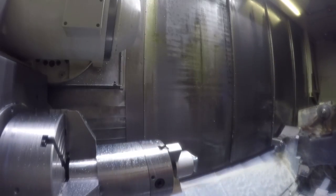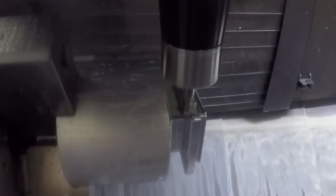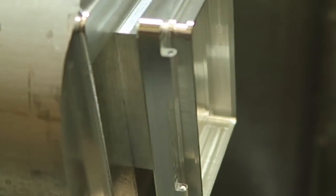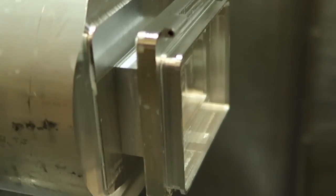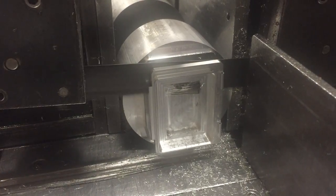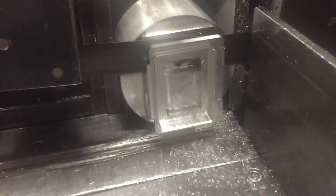We come back with a double chamfering tool to finish the chamfer on the outside of the case. That finishes all the machining. Then I cut it off from the bandsaw — I could have used a circular cutter in the mill, but the bandsaw seemed like an easier way to go, cutting it off as close as I can without hitting the saw blade on the part itself.